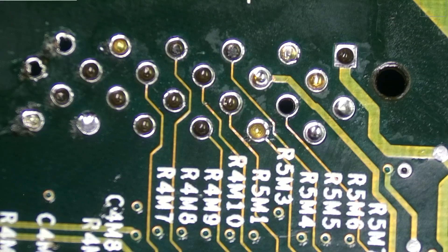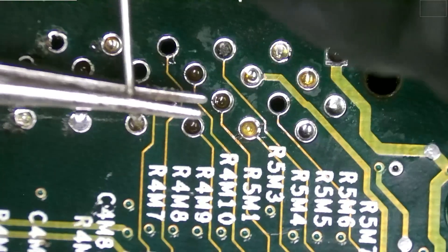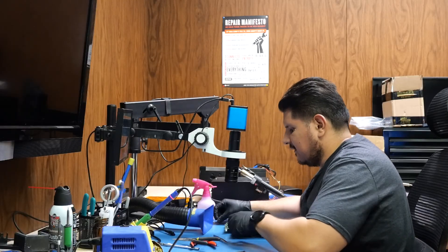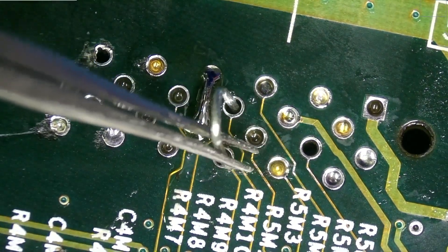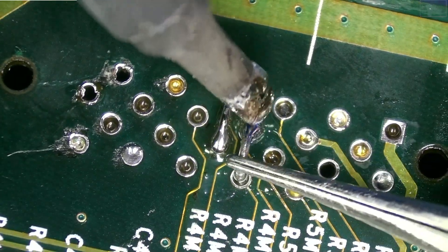We need to install the jumper to pads 11-12 and 13-14, which is going to be from this side — right here, and right here, to here. I'll fold this in and use some tweezers to bend it. We'll go ahead and solder that in immediately — add a little bit of flux, because flux is good, messy but good. We have that first one tacked down. Let's cut it off and pre-bend the next jumper; it goes right next to this other one. We should have enough flux from the previous jumper to continue. We're going to press down on it with some tweezers to keep it from moving.